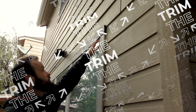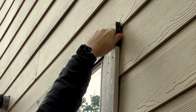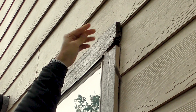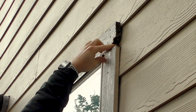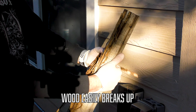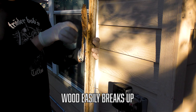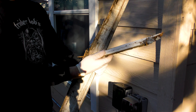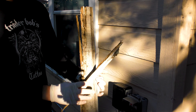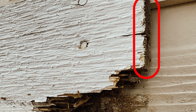So back to the trim. Seeing my friend's post prompted me to take a look at the trim around my house that was built about 15 years ago, and to my horror I discovered that one of the windows — the largest one and the only one without an overhang — had the top board turn into exactly that mush. It completely rotted away. The reason for it is visible on the side: whoever painted the trim decided to save time and did not fully seal this piece of wood, which then over the course of 15 years almost completely disintegrated.